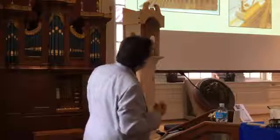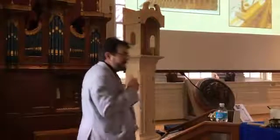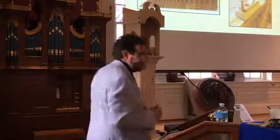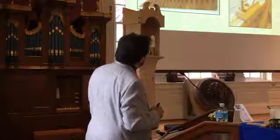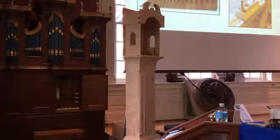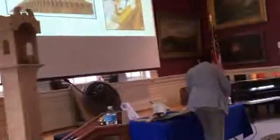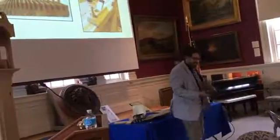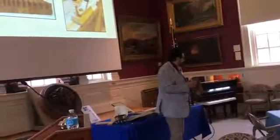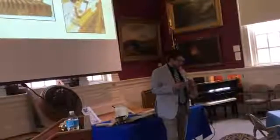And it was cheaper to get it that way. Again, hand planing. So all the moldings on this can be done with a hand plane. They can be done modernly with a router, with a shaper, but they can be done with a hand plane. And we have a hand plane here. I'm sure everybody sees a hand plane. And the hand planes today are very valuable because they match historical profiles from London or from England in general, and France, and from the colonies here.